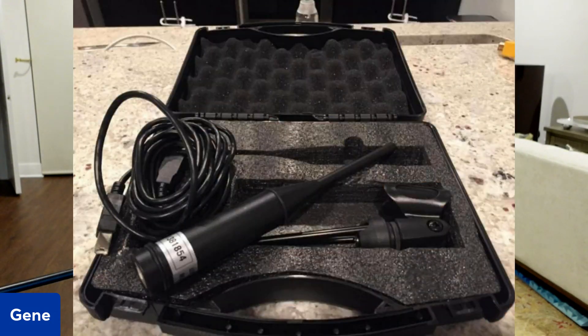The first thing I really want to stress to you guys — please get one of these. Get a calibrated microphone that's USB interface to your laptop. I personally use the Dayton Audio UMM6. I'll put a link in the description below. It's a pretty good microphone, not that expensive — under $100 — and it's got pretty decent accuracy down to about 20 hertz. That's all we really care about: getting good bass integration for our speakers.